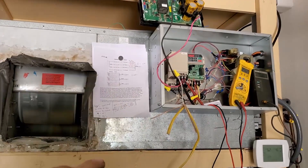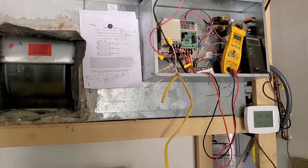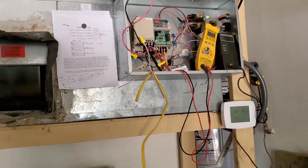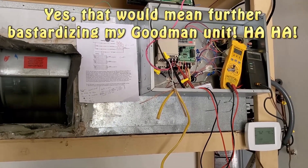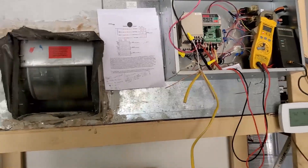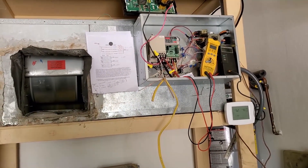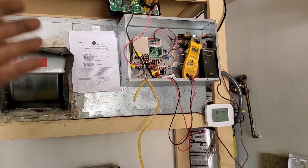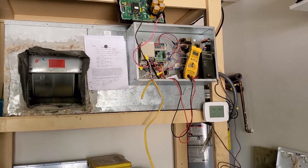I didn't intend for this to run off solar — I'm just using this to test my new solar panels. My intention is to run my master bedroom and maybe one of the other bedrooms upstairs just off-grid once the sun gets over on the west side of my house — that would be right when peak use kicks in. If the panels produced enough, I would consider putting a three-phase compressor in my upstairs AC unit, drop it down a little bit in capacity with an ECM blower, and just be able to run the whole upstairs central air directly off that. So if I can run this 2-ton compressor directly off half my panels, I think I could run a 3-ton compressor no problem, maybe even a 4-ton, because this is not a fair test — the compressor is loaded heavily when it's got 120-degree water cooling the condenser side.